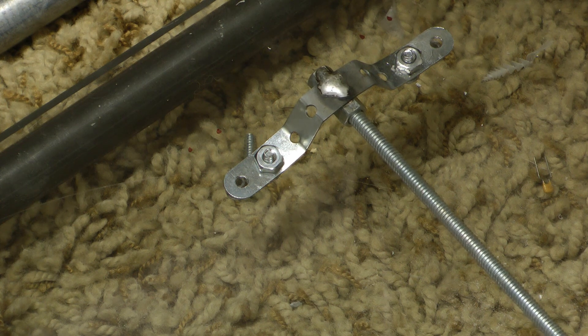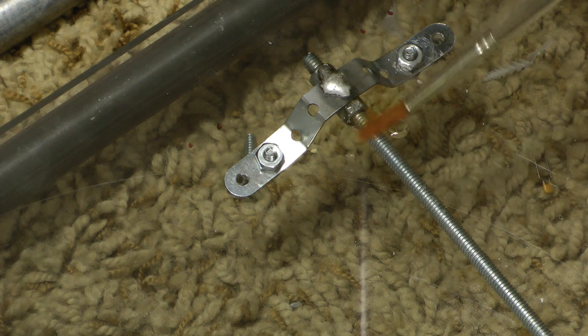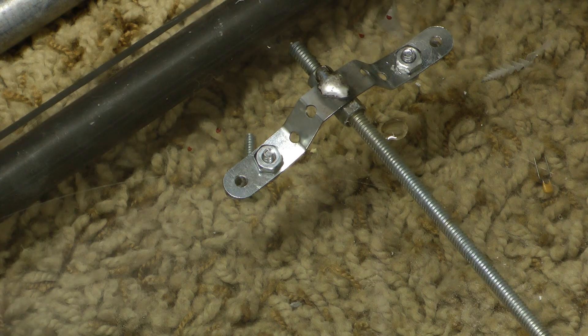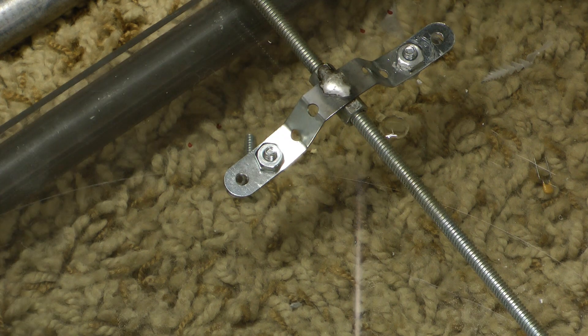I will give you a hint, however: oil is your best friend, no matter if it is in production yet. Oil is your best friend. Just a little bit of oil and a paintbrush right in that area, just down the actual shaft itself. That will make it like a thousand times easier. Much better. This is going to take a while. I haven't cut this rod yet and I will later, but for right now I'm leaving it at the full — I think this is actually a thirty-six inch length. I have to build a bracket in order for this to twist around on the other side of the actual device. So for right now, this is my job for the next hour.